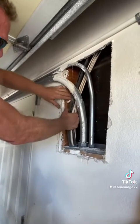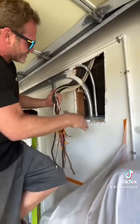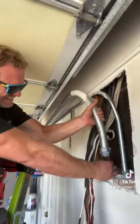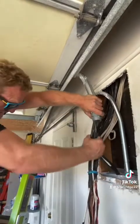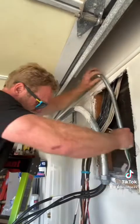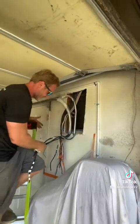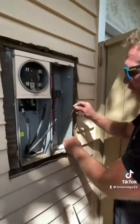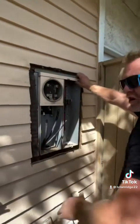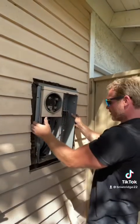I used that Romex as a strap. Now I've got the circuits removed and I can pull the pipes out. I've got all the wires removed from the top so I can pull the panel out from the other side. Because I have a number four copper for ground in Moorpark, they state that you don't need a ground rod if you have a number four copper ground, so I don't have to install a ground rod on this job.